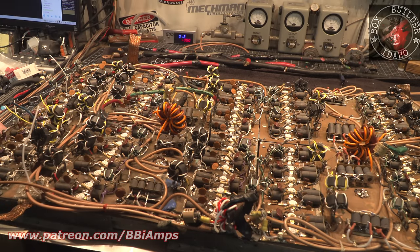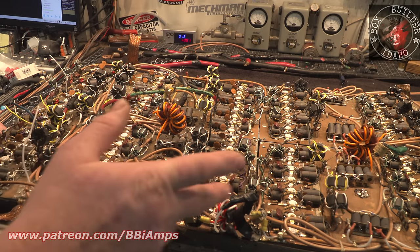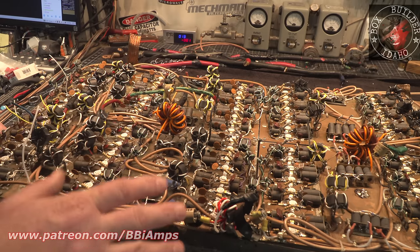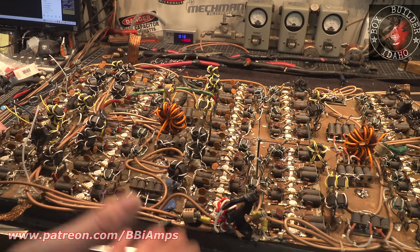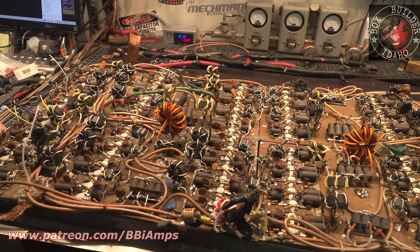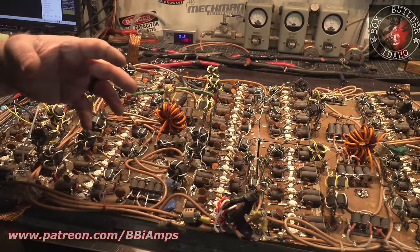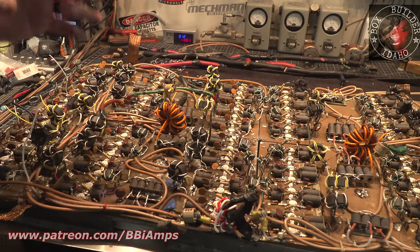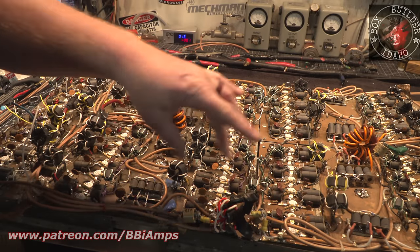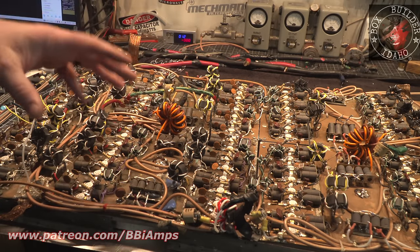Now, mathematically, we can run into a wall, the efficiency of the component. All these transistors are about 60, 68%. On a good day, with a soft breath of a young woman blowing upon the part, you'll get 68% efficiency somewhere near out of the part. So the only place that we can make an appreciable difference in gain, and not really gain, but an appreciable difference in how efficient the circuit is, is how efficient the parts are around it. How closely configured can we get the components tuned to the transistor?